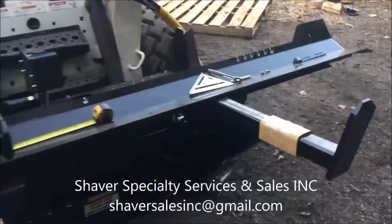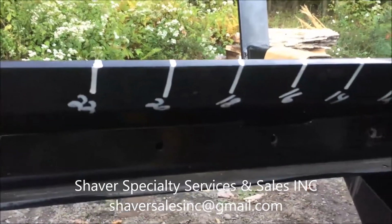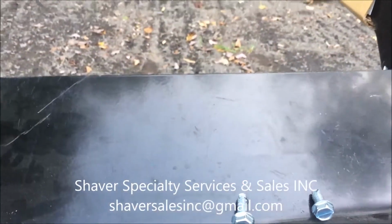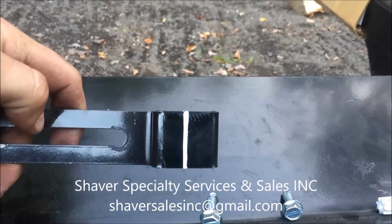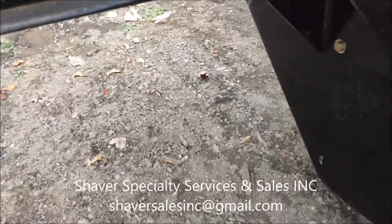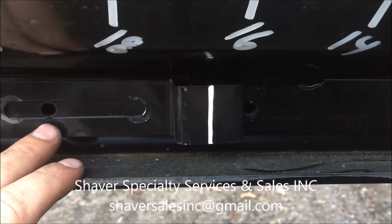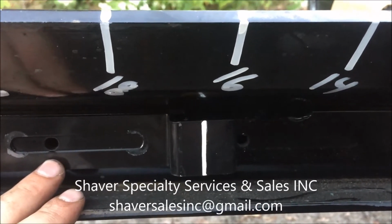All right, I went ahead and opened the tray table all the way up. There we have our marks in the front. I came around here to the back and made some matching marks. You have these 4 holes going across the back, and you have 2 screws here and here, and this is the new guide bar that bolts into those holes. And when that white stripe that I put on there comes in front of the sensor, right in the center, that's what marks the cut length. So what we want to do is try and get this in the hole closest to the 16, maybe somewhere like right there, using this hole and get things lined up for 16. So we can get this put on there, and I'll pick the camera back up.